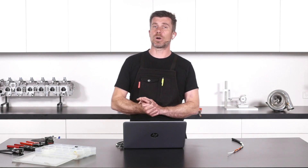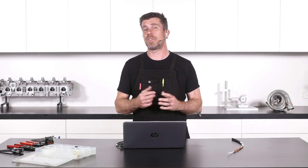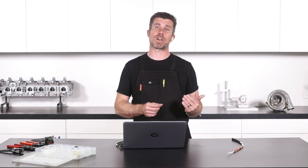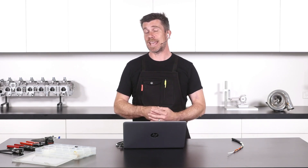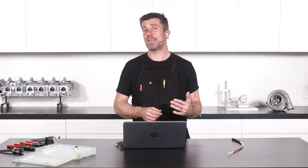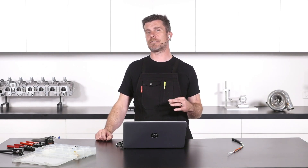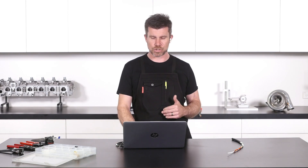Now this does present the problem where the solder will work up our wire. So once they're soldered on, they're then going to be potted — we fill the back of that connector with epoxy, which provides the mechanical strain relief and support. Then, once that epoxy has set up and cured overnight, we apply a heat moulded boot to the back of that particular sensor or connector. These heat moulded boots, once they recover, are pretty semi-rigid, providing further strain relief.